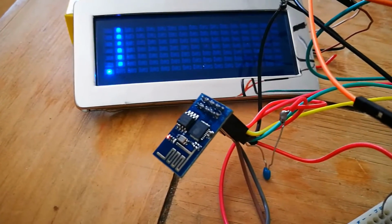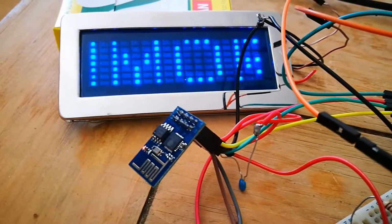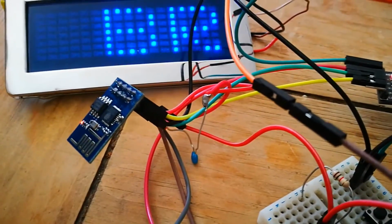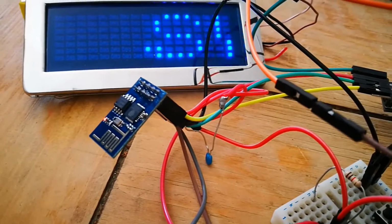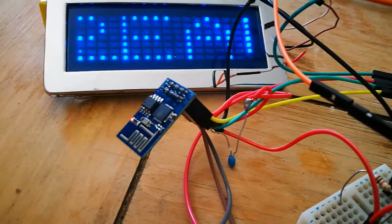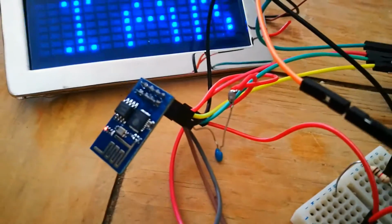And I guess the main disadvantage is it doesn't have as many input-output pins. However, there's only 2 user input-output pins, but you can use 4, and the other 2 you can use are the 2 serial pins, and they can all be programmed for input output, so you can then have up to 4 input outputs, but you will sacrifice the serial interface if you do that. You can also use 2-wire, and I guess you could add your own multiplexers and demultiplexers to increase the input outputs. Nevertheless, as I say, it's a very capable device.